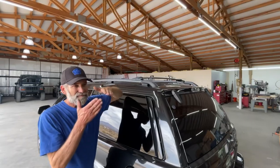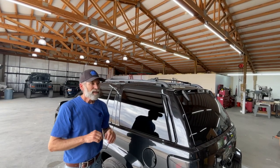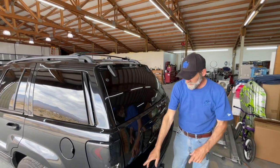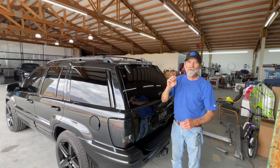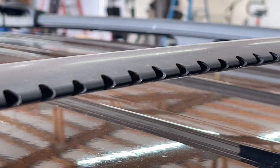Because it is on that V, I did a little bit of filing to get it flat and get a start. I think there were 5/16-inch holes, and there's an LED that lines up. It's one of those LED strips, one hole every 3/4 inch. After I drilled all those holes, I took a round file and actually filed each hole by hand. Wow, it looked really good.